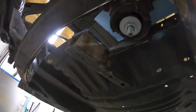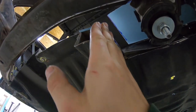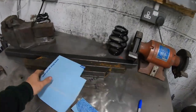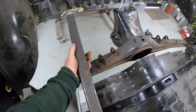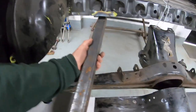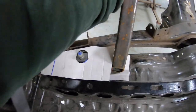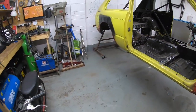I'm going to cap off the end of the chassis rail and have a big plate that goes up, and that'll box that all off. I've capped off the chassis rails at that end. I've got some nice 40mm box with a big chunky wall. Basically from underneath that chassis rail it's going to stay high then angle down, tying into the side of that box. That should be the front mounts all buttoned up.